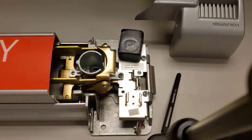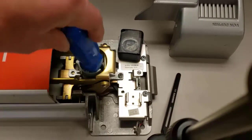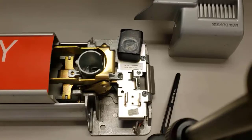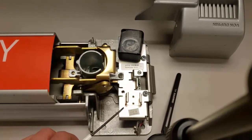The interesting thing about the 2670 is there are two components on this that are timed. First, the actuator that your rim cylinder tailpiece goes in has to be timed correctly during initial install, and there's a small actuator right underneath the board that also has to be timed. We're going to go over those now.